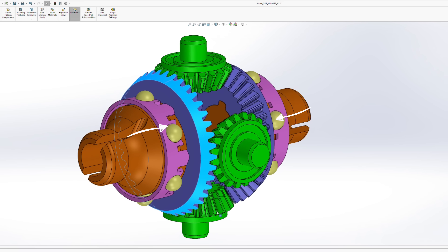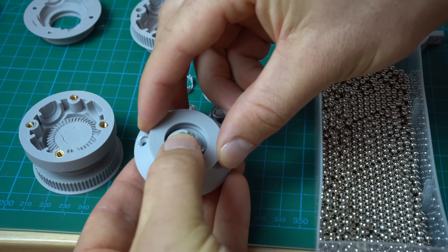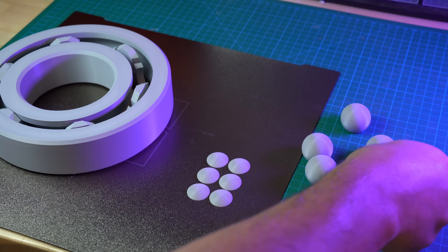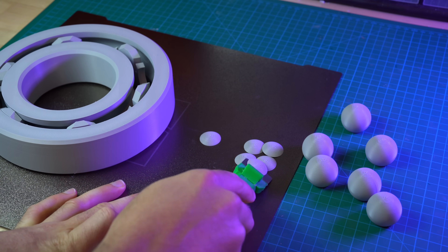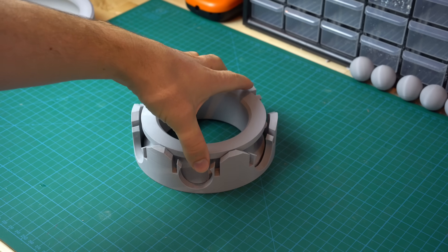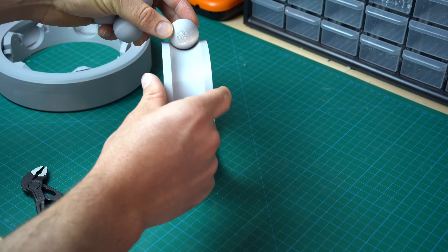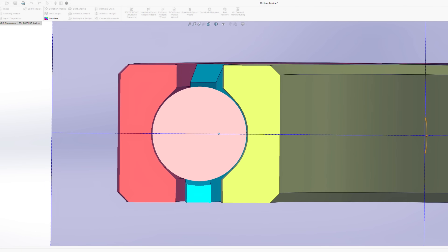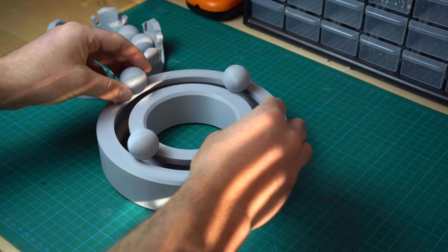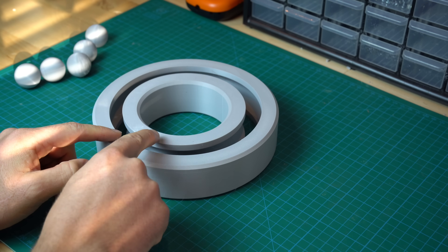I was able to design the four spider gears to use off-the-shelf bearings, but given the larger size of the other sets I had to design them custom to be 3D printed. These custom bearings are really small and hard to see, so I'm going to use this comically large one to explain the design. The bearing comprises four main parts: the outer race, the inner race, the ball, and the cage. The races are designed with channels just slightly larger than the diameter of the ball itself. The air gap between the inner and outer race is the true genius of the design — that gap is designed to be exactly half the diameter of the ball.